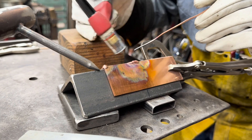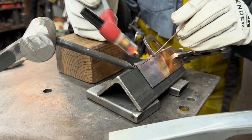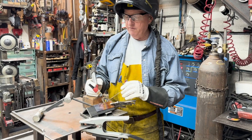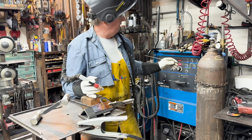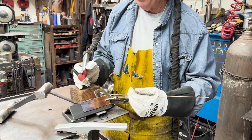I'm going to start at the front and just run down the road with this at about 160 amps, pedal all the way down. Then I'm going to finish up this weld with some silicon bronze, 1/16th inch. I've dropped my amperage down to about 130 — again I want good penetration but I want to be able to grind the top half of it.